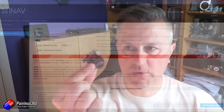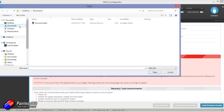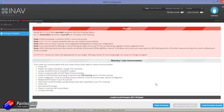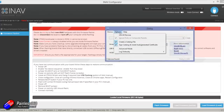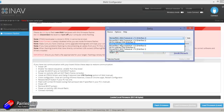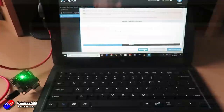Plug the board into iNav or Betaflight and flash it as normal, but this time load the file you've just downloaded. Make sure you've got full chip erase selected and click load the software, then click load firmware. If it doesn't immediately work, use the same tricks we always do with things like Zadig. I've put a link in the description to my Zadig video that shows you how to use it.